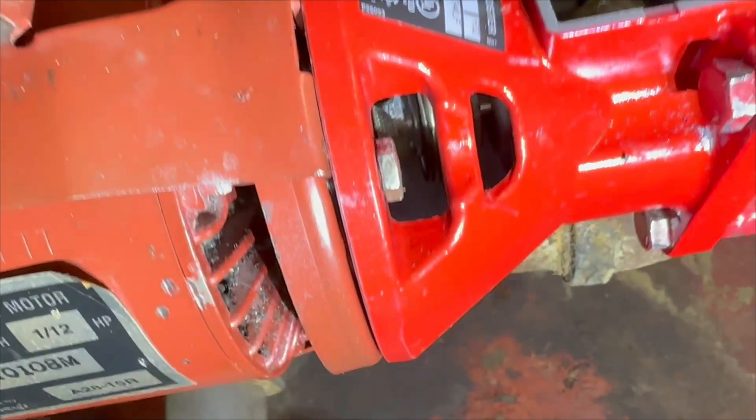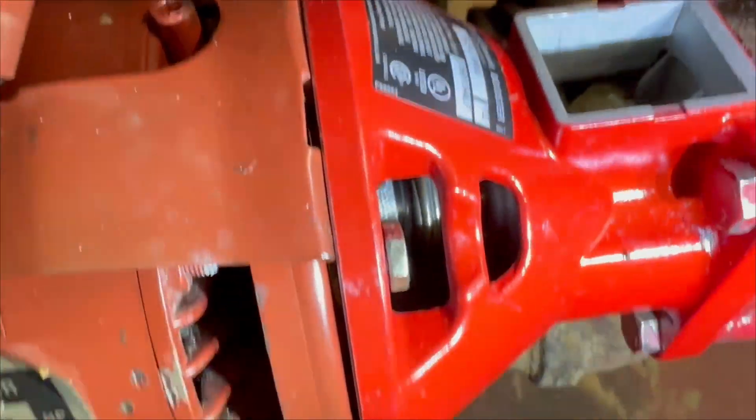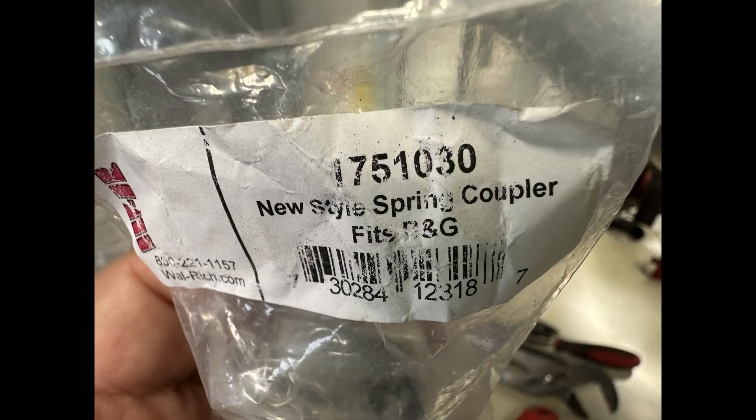I put it back together. I just turned the power back on - let's wait a few seconds, it has to go through safeties, and then it's gonna turn on. There you go, that's running - no more noise, it looks good. The coupler part number is 1751030 and I'm gonna put a link in the video. Again, this video is just to let you know that when the coupler hits the bearing assembly, 90% of the time it's because the motor mountings are saggy and worn out due to over-oiling and age. Thank you so much for watching, I'll see you next video - please don't forget to like and subscribe.